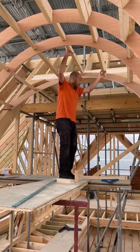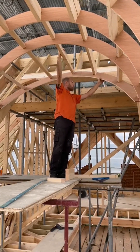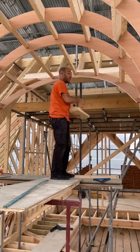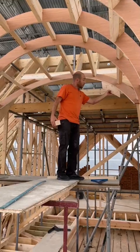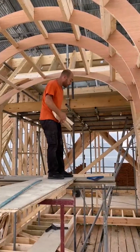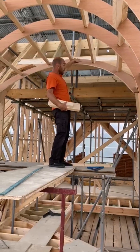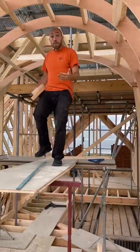You've also got a couple of ways of doing this — you can either do a bulkhead depending on the weight. This is quite light so I'm not too concerned, but if it was heavier, I would do my bulkhead double going through onto my triple rafters. So that would go through on 9x2, stepping down in a curved bulkhead — one across, one in the middle, then one at the bottom and top either side of the middle. What we have done is run it straight through. We'll notch it out, follow it right through, cut it with those lines. We've got a 6x2 at the top to take some of the weight, and we'll also infill it on the outside with timber, ready for the roof so it's got something to fix to.